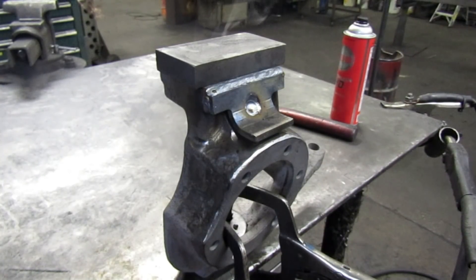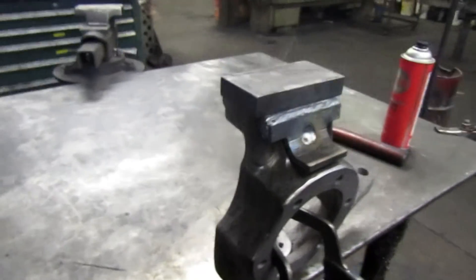Make sure no spatter goes down into those holes. As you work around that knuckle, the anti-spatter burns off and doesn't provide much protection once it's burnt off. So with threaded holes like that, not bad to put a little extra protection on them.